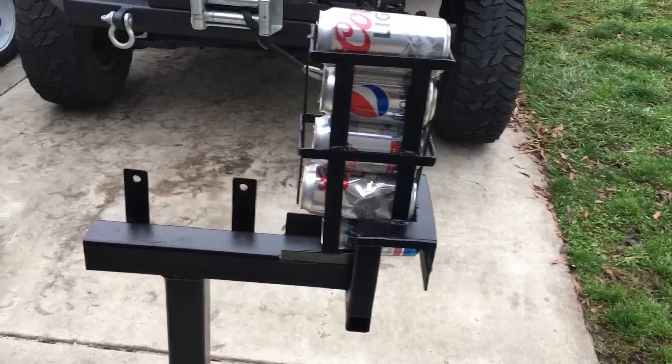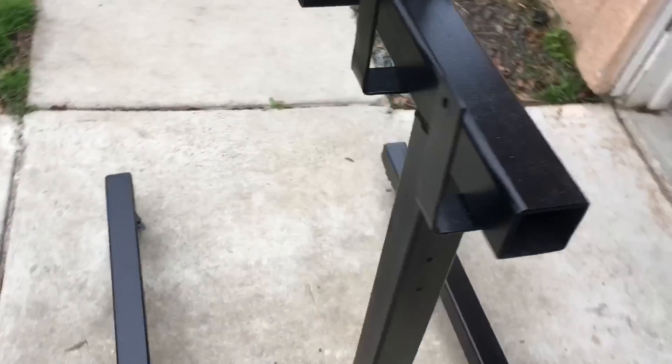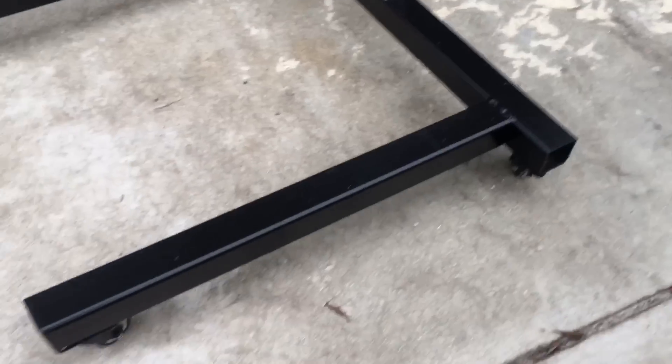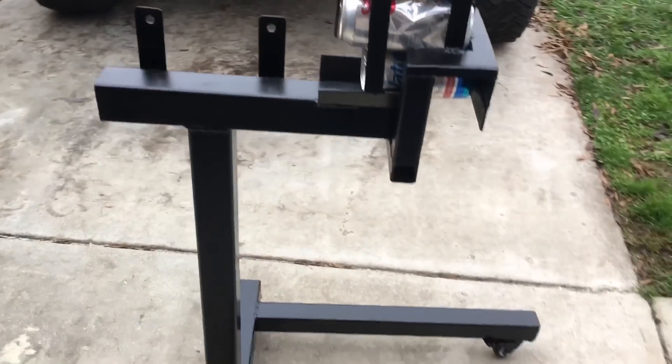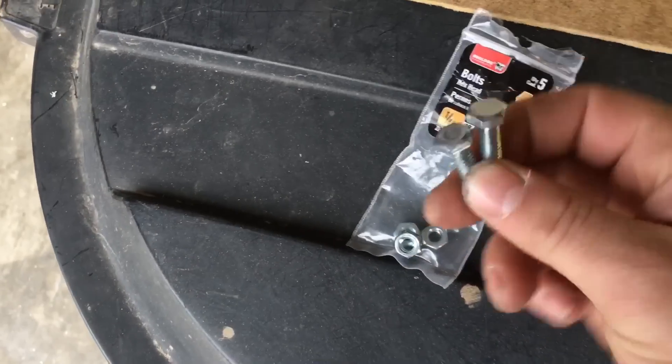Here's the finished product. We've got our cans sitting in the hopper. Built a stand using 2x2 steel, some angle brackets that I bolted to it, and better removal for the proximity switches. I bought some nice 2-inch casters and bolted those to the frame as well. Now we're going to install this panel — on the back side I've drilled 2 bolt holes, tapped quarter-20. I've pre-drilled 2 holes here and we've got some quarter-20 bolts picked up from Home Depot, with some washers.